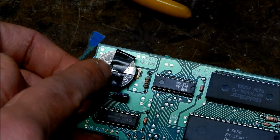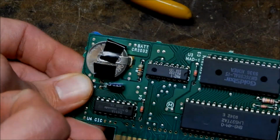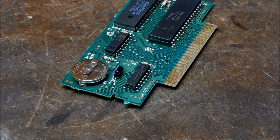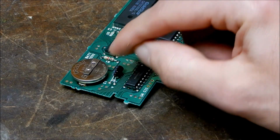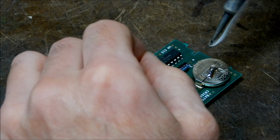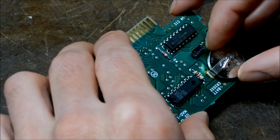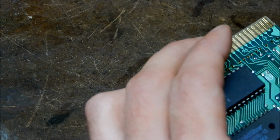which is actually soldering the top tab to the battery itself with a very small little blob of solder. So your choice. So let's try the other method. Okay, so we're going to solder the battery to the little terminal now. One of the things that I have done here is taken a little sanding block and actually sanded down the Energizer logo so that the solder will stick to the top tab. Just needed to get a little tiny blob on it.